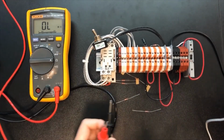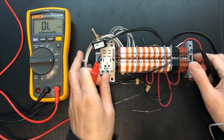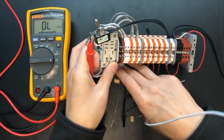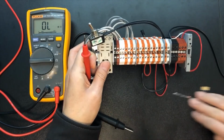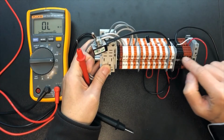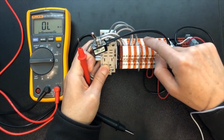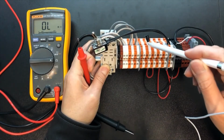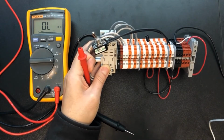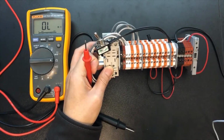All right, so now you can start the lab by building this circuit. Apparently, you have, let me clean up here. Right. You just connect them in series, right? The power supply, switch, resistor, capacitor, and make sure you connect the shorter lead here to the negative terminal of your power supply. That's very important, right? Before you do that, make sure your power supply is disconnected.